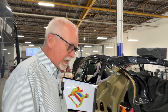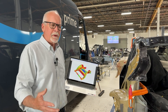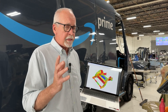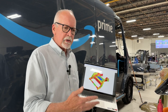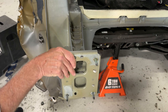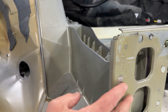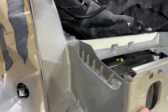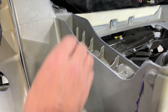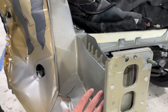What we wanted to talk about is gigacastings — how to inspect, how to find damage, and what can you fix. There are some myths about what happens with gigacastings. One important thing is you can repair a lot of the gigacasting. Early on it was sort of an all-or-nothing thing — we had to replace them — but since then, lots of repair methods have been developed. For example, we can see a line right here where we can section this rear frame rail. If this was hit and fractured, we have the option to literally cut it off and attach a new piece of cast aluminum, joined with rivets, structural adhesive, and a backing plate.